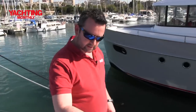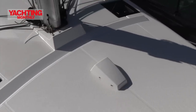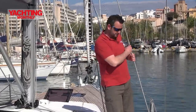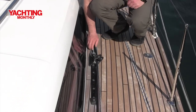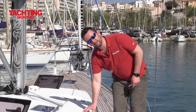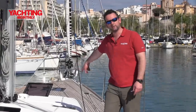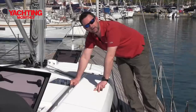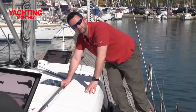This model doesn't have it fitted but there is a self-tacker option. Moving on, there's a bit of a swing past the topside chainplates. I wonder if they might be better positioned elsewhere - we couldn't get desperately close-winded yesterday, so the sails aren't desperately well cut on this boat, but I thought if the track was there you might end up with the sort of pointing you get with a self-tacker. These chainplates are a bit too far inboard, so if I'm walking up the high side I'm pretty much about to launch down.